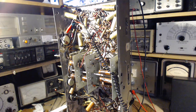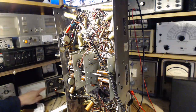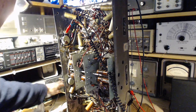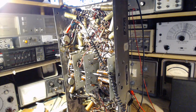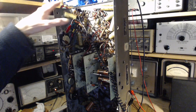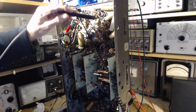We'll use the indicating meter — it's on a 500-volt scale. First we'll check right where we're injecting the B+. There it is on the meter. Something just slid off my bench — scared the living daylights out of me. It's just under 200 volts, about 175. Now we'll see if we can find that voltage elsewhere. There are nice big red wires all over the place. I pick one — and there it is, 175 volts.